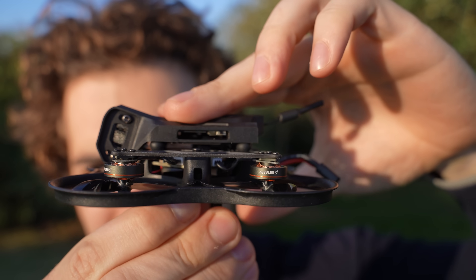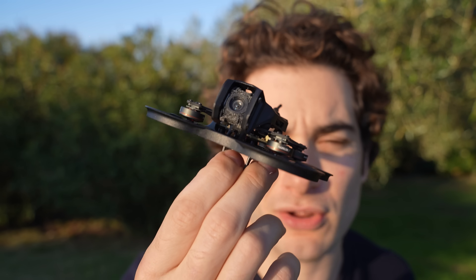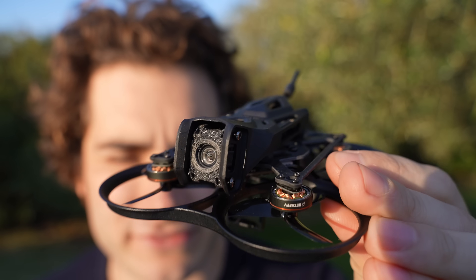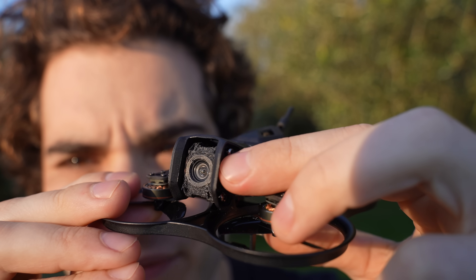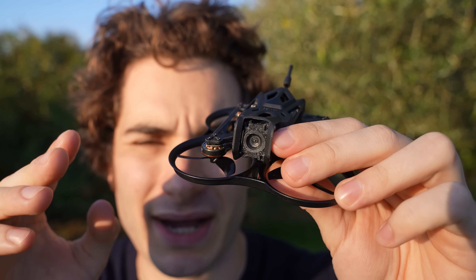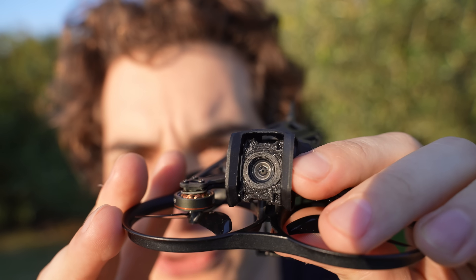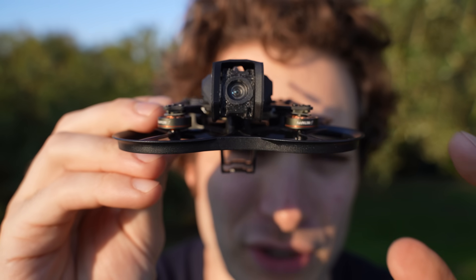This mount is suspended with soft mounts and it's quite soft because the O4 Pro doesn't usually have too much jello. The O4 Lite is a jello machine — it's been very rare that I've seen it without jello on a drone. I remember the camera assembly from the Pavo Femto had jello because they soft mounted the camera directly and not the whole assembly. My O4 Lite camera mount is 3D printed; to mount it on this drone you need the original DJI camera mount with the dual screw setup, so make sure you have it.